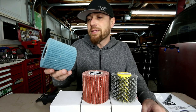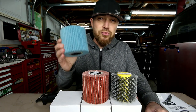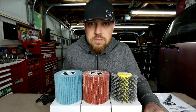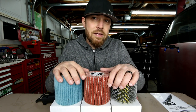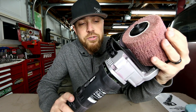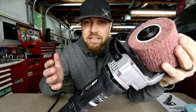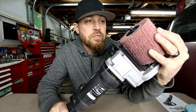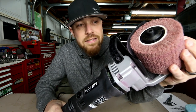The last drum they offer is what they consider the finishing drum — about 320 grit. It feels pretty soft to the touch and is really the last drum you want to hit for a nice finish on your metal. These drums aren't available yet but are coming soon, so you'll have more variety and more choices. One feature I really like is that it has a speed ramp — when you pull the trigger it's not instantly full speed, so it's not torquing out of your hand. It starts off slow and gradually comes up to speed, which makes it easier on the machine, the drivetrain, the drums, and your hands.